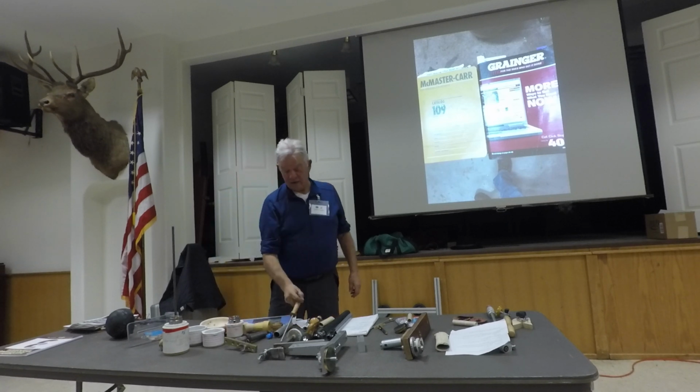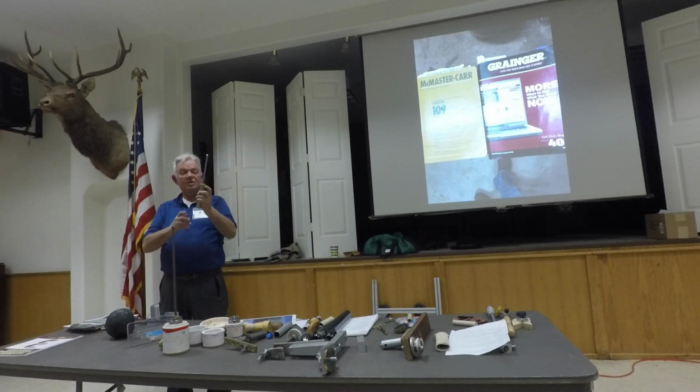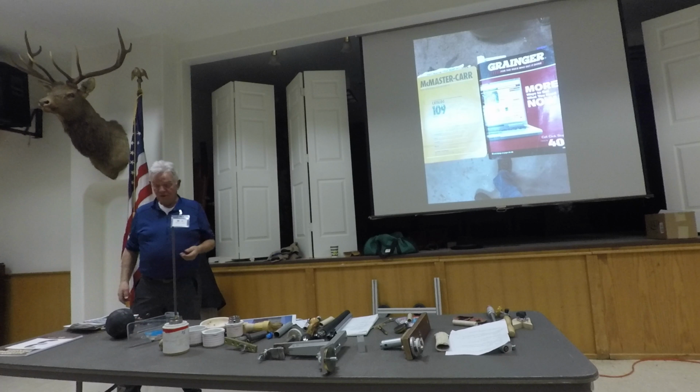And I think we passed around these 3-point tools. Ed Larson is the one that had the idea about putting a nut on here, because when you go to sharpen this, you lay this on your table in front of your grinder, and sharpen there, skip one, go to the next one, skip one, go to the next one. You got your 3 points, and you always go back to the same spot. There's no question about whether you're off a little bit. That was one of the best ideas. And that's what's fun about these meetings.